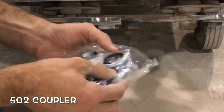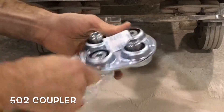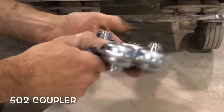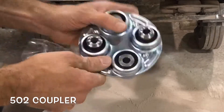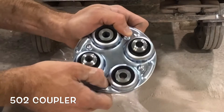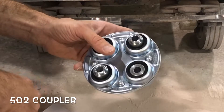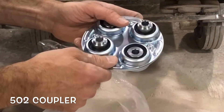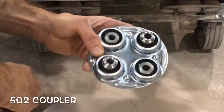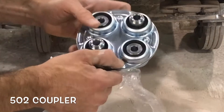When asked why we use the expensive couplers for the junior, this is exactly the reason that we do. Unlike the urethane style ones that are on the machine as standard, these are two pieces of steel that actually sandwich rubber bushings inside and hold them tight, then it's riveted in four places so that when this runs over stuff that's a little more than what the grinder can handle, it can flex with that and not break. Certainly they can be damaged and eventually fail, but much longer lasting than the urethane donuts as we call them that normally come with the Chinese machines.